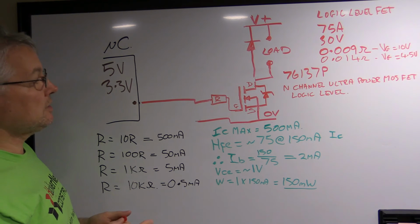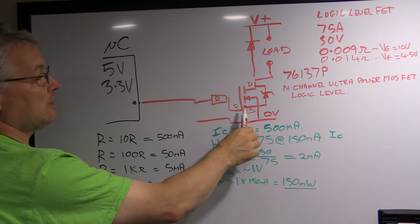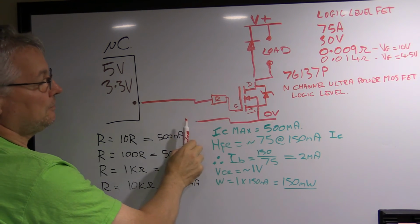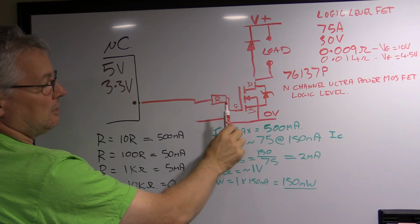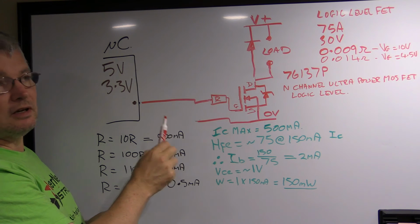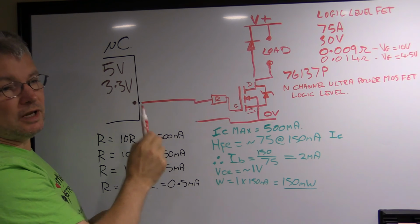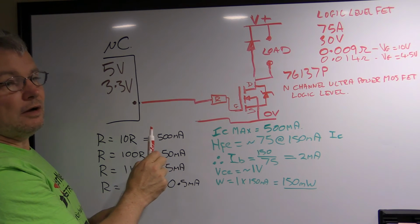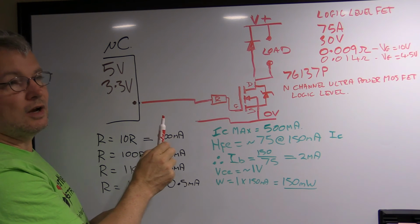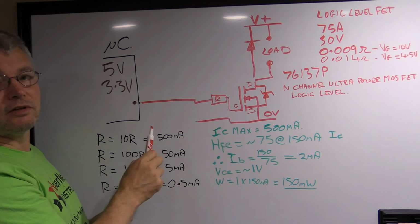And what it actually means is, most FETs, you have to take the gate. They have a gate, a drain, and a source versus a base, emitter, and collector. Sorry, collector and emitter. And they're a voltage amplifier. Remember before, when we were talking about the transistor, they actually amplify current. By varying the load resistor and the base resistor, you're affecting the current, and the resistors are effectively changing that into a voltage for you. But the transistor itself works as a current amplifier.